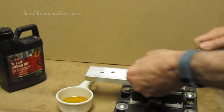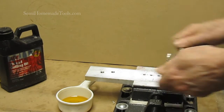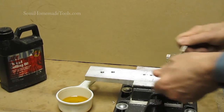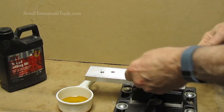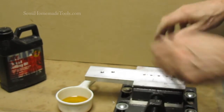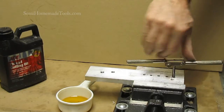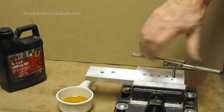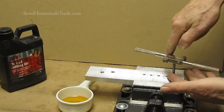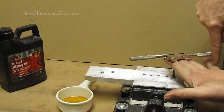If you get to a point where it is tougher than you want, you'll end up breaking your tap. You can replace the tap, but the hard part is getting the old tap out of the hole. Once you get most of the way through — this is only a half inch long so I've gone pretty well through — you can just keep on going and that's going to clear out the chips for us. Eventually we're going to come back out. When you get near the end, you want to steady it so that you're not tipping and chewing up the very first threads in the hole.